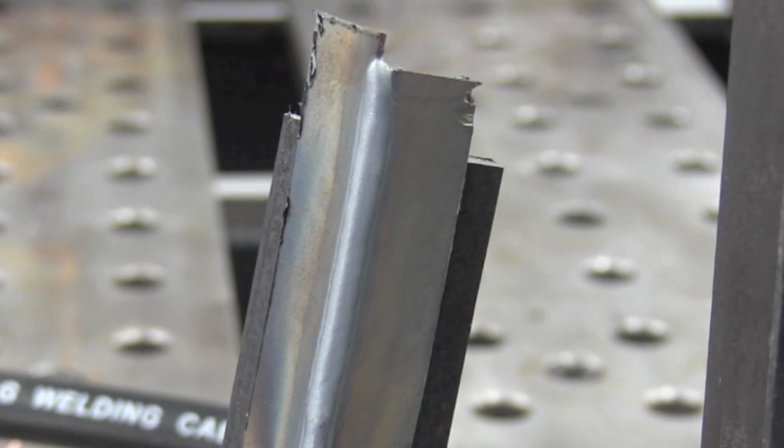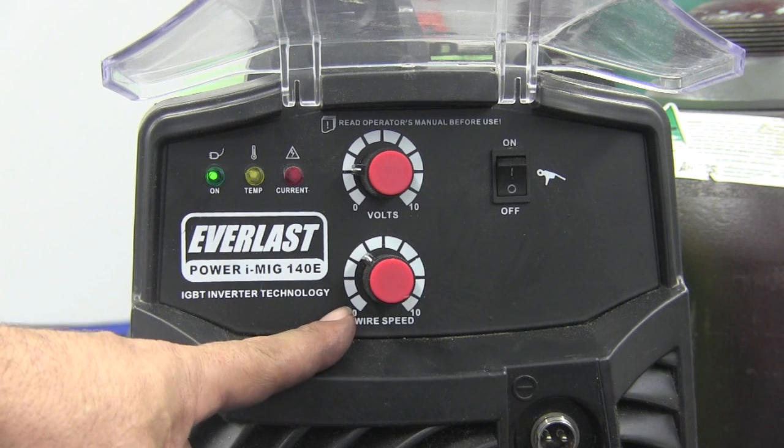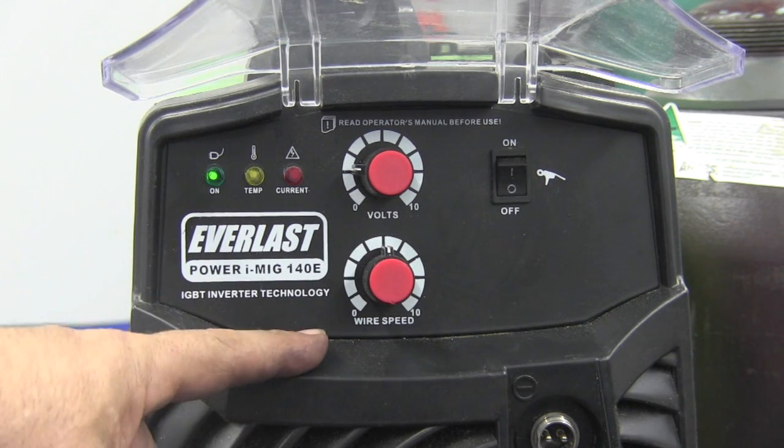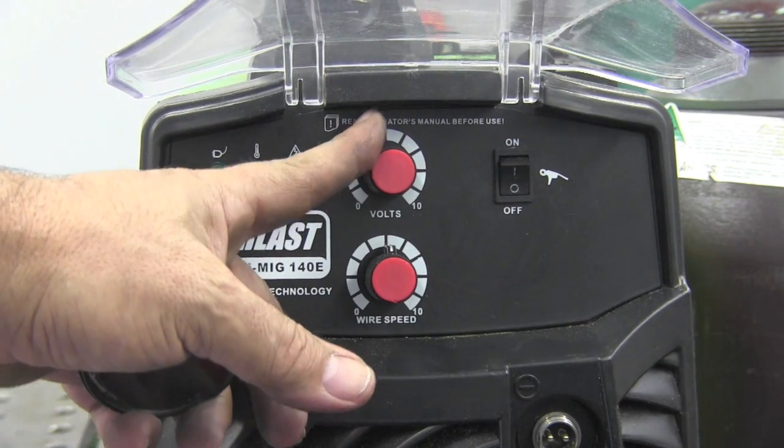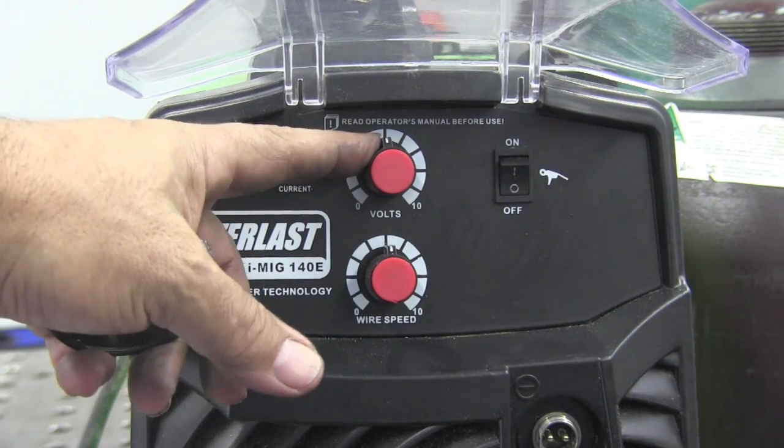That's actually working out pretty well — a nice smooth arc. I just set the voltage to match on a piece of scrap. Now we're going to weld some eighth-inch thick, so I've got to crank it up a little bit. I'm going to take a guess and set the wire feed speed to about what it needs for eighth-inch thick metal, just guessing at the voltage and going from there. My first stab is actually pretty close just guessing — you can hear that arc is pretty darn smooth. I increased the voltage a little bit thinking that would improve things, and it did — made it even better.